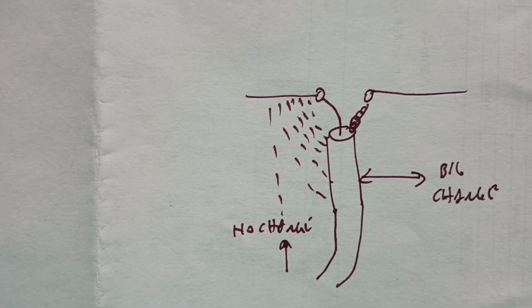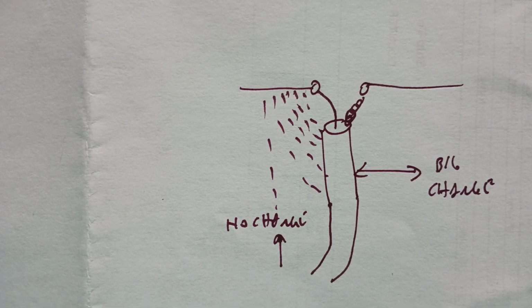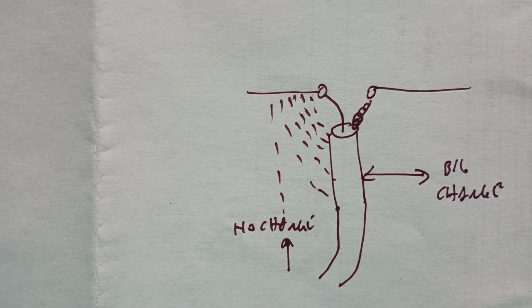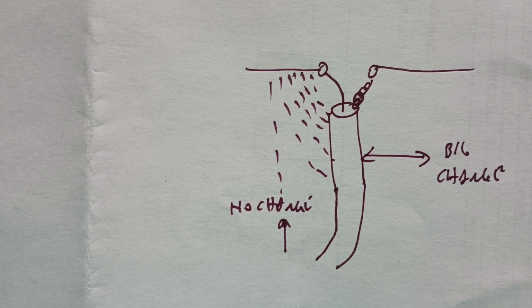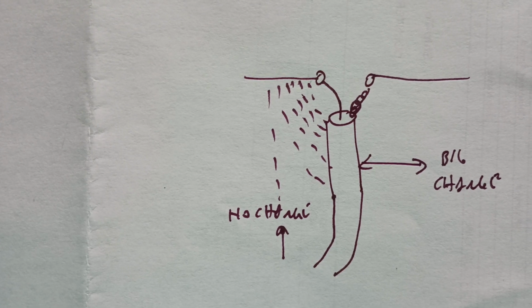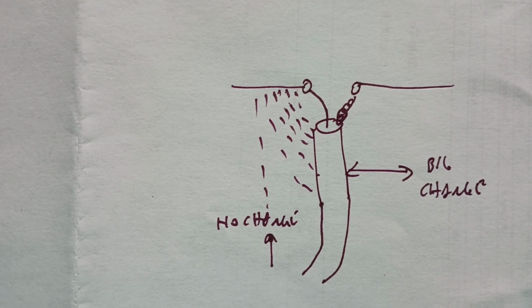As that distance increases, as charges go further out to the left along the wire, those lines of force get weaker and weaker because it's very quickly traveling away from the shield. And at some point, they'll jump off and connect to the ground. Because under Gauss' law, I think it is, the magnitude of the force lines is proportional to the charge on each conductor times the other, and the square of the radius, and that's modified by cosine theta. So as distance and angle increases, those lines between the wire and the shield get very weak. But that's just what they need to jump off and couple with the ground. And that there is the secret of what causes the dipole matching.